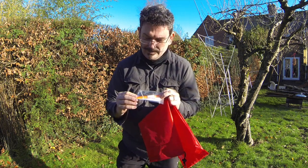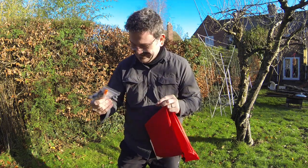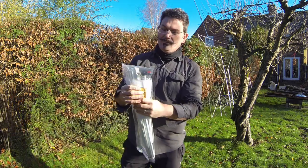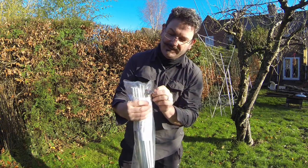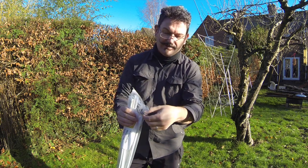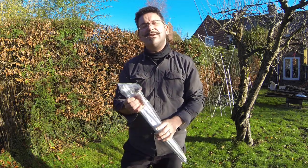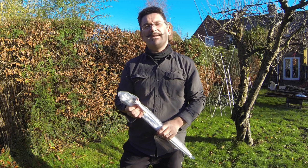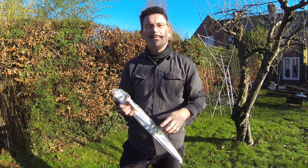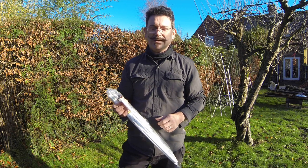And finally, end caps and some additional spreaders - interesting to see why we've got two sets. The antenna is fed with coax terminated in a BNC. One of the spreaders has a BNC connector and a couple of terminals to connect the antenna wire back to. Richard recommends feeding this with coax via a little balun, just to stop the coax from becoming part of the antenna itself.